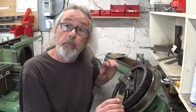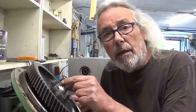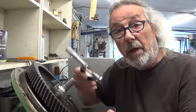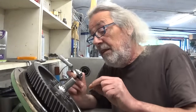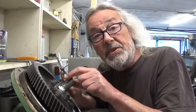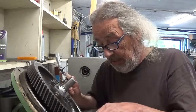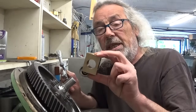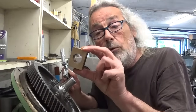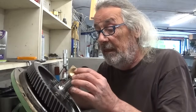But the problem is, as expected, here on the crank pin. I took a bunch of measurements around this crank pin with my tape measurement thing here, and this is cylindric. The pin itself is perfect, so we're not gonna touch this one. And unfortunately I don't have the right measuring tool to check the roundness or the cylindricalness of this hole here.